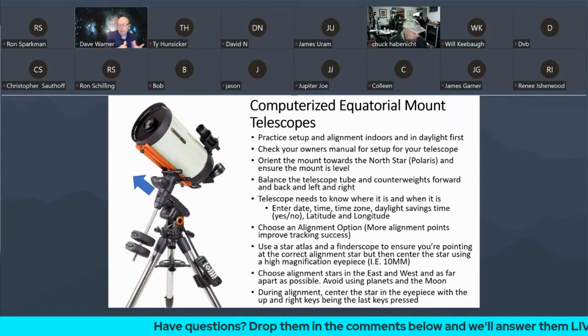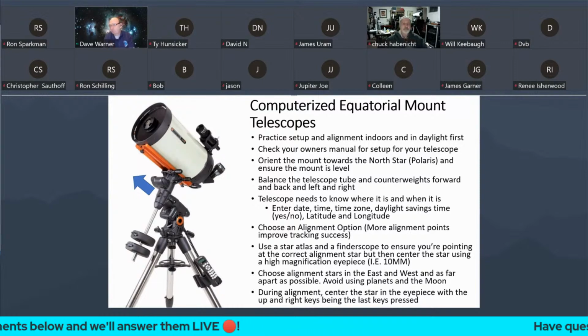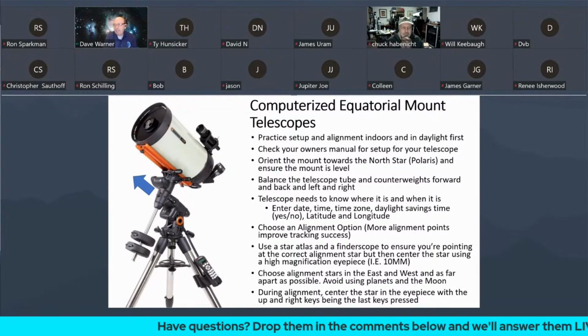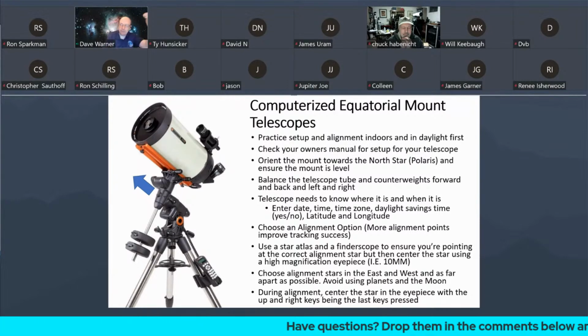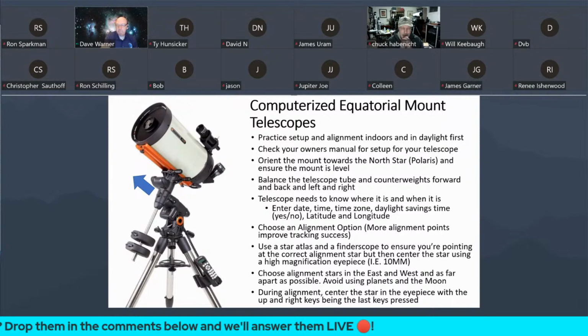But when you do that initial alignment the very first time, it only gets you so close. After you do that initial alignment, you calibrate the camera, and calibrating the camera will center it into that cone of alignment that it just created. Then, once you've calibrated the camera with the alignment you just did, you actually do have to go in and do a second alignment. And that second alignment will get you to where it's really a great device.